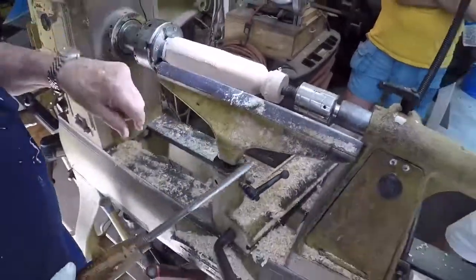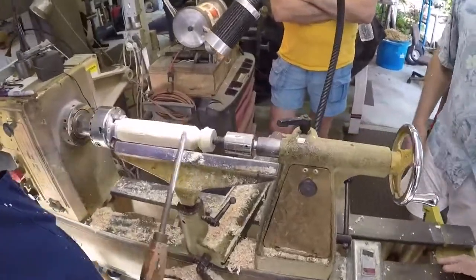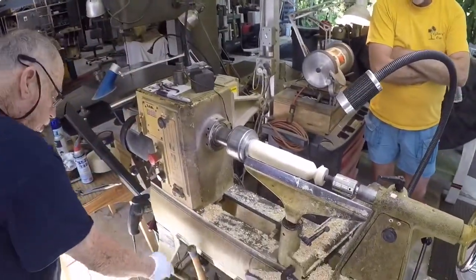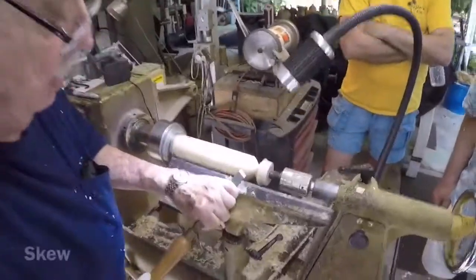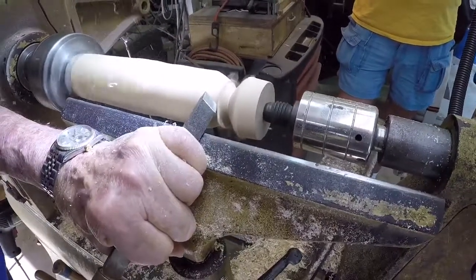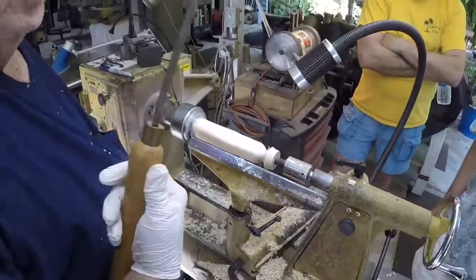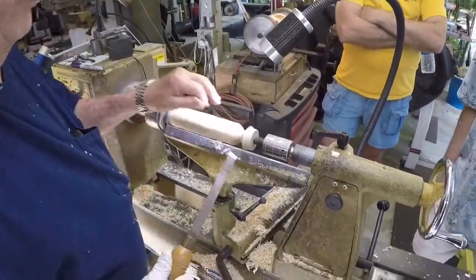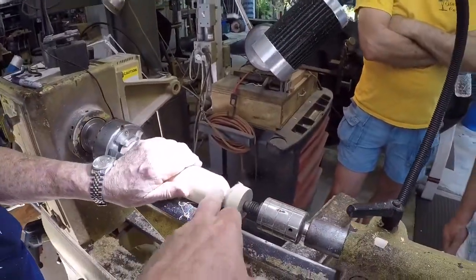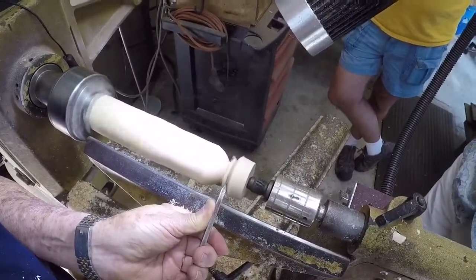Put your finger over there and feel it — check that. It's like nothing. See the light reflecting off of it — that's from using your bevel. Those are the very important things you do with this tool. You notice where we're cutting with this? Right on the very tip — a thirty-second of an inch is all that's ever going to touch the wood. And you can feel that — it's dead smooth. I can see from here that it's shiny, and that's a good clue.